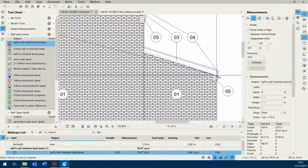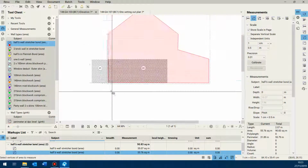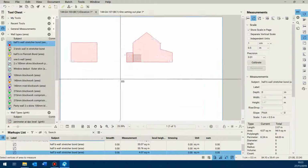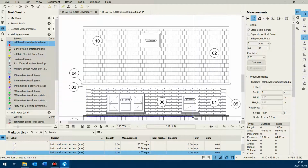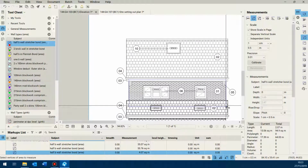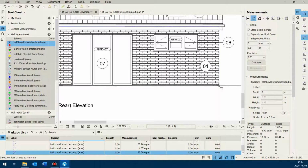But you're best to double check through your section. Sometimes your plates obviously go higher on the inside. And I'm going to add my DPC splashes in from the girth I've taken on the other plan. Staying in the same tool. We drop it about there. Obviously there's going to be block work in behind that little roof space. You could measure the whole thing as face work if you wanted to, and do it as an extra over.